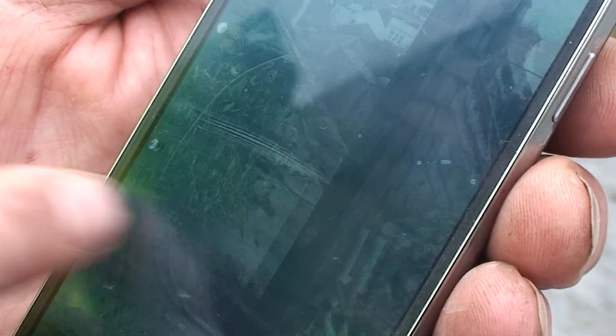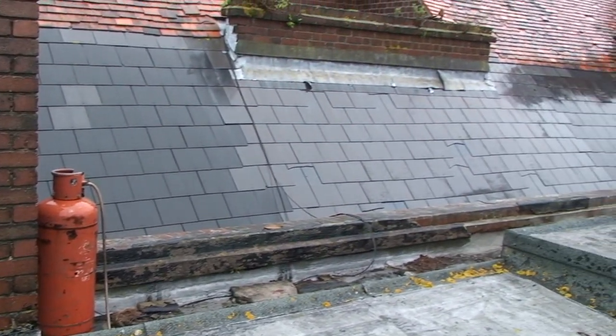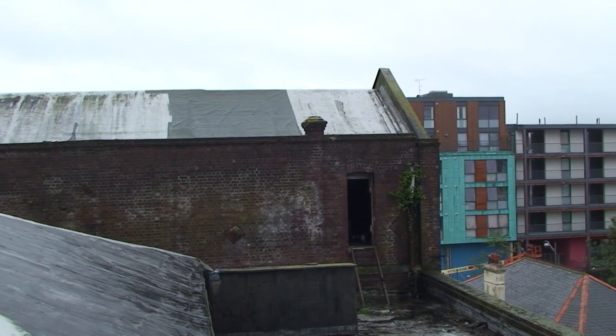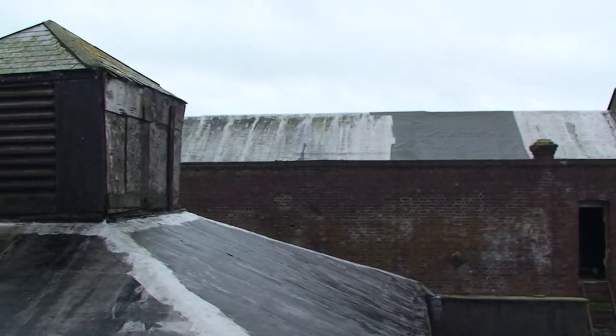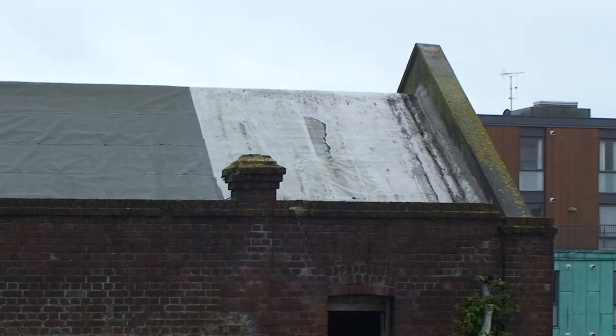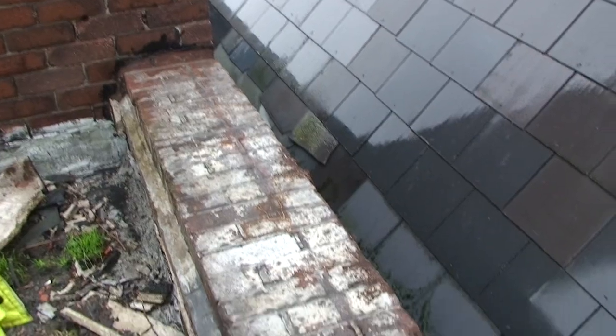This is how it looks growing on the roof — the valley down there had all this vegetation growing out of it. That's because people have nicked all the lead flashings. The area covering the back of the stage had all been taken off, but that's all been flat-roofed again. The valleys have been dug out and temporary valleys put in so they don't leak down into the stage area anymore. The valleys are all clear now so the water can run down and go out through the drainage instead of going down through the building.